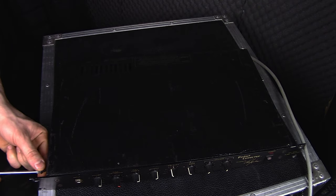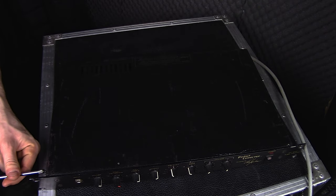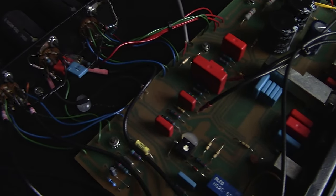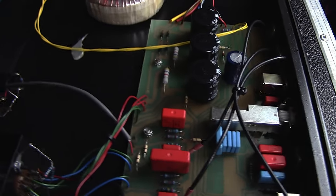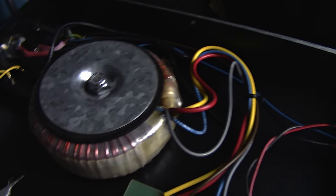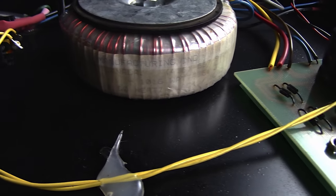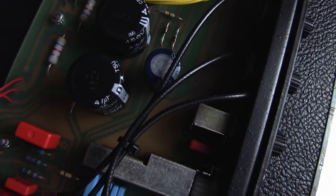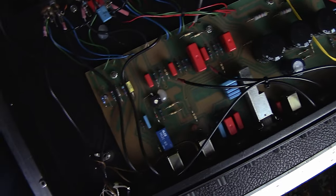And as we know now, he put the EQ in front of the gain stage, and it shapes the sound before it gets distorted, like old Fender amps did. The problem is that once the preamp is set into saturation, like distortion does, the EQ effect becomes less and less. Since most people crank everything up when it comes to the input volume and distortion, the saturation is fully maxed out for the preamp, hence the EQ does nothing. In his own words, changing the position of the EQ would hurt the magic of the GP-1000, and to be fair, I guess he's absolutely right.